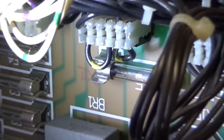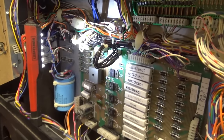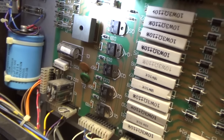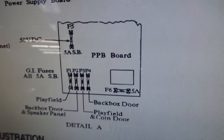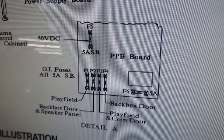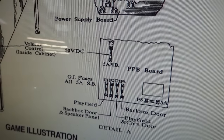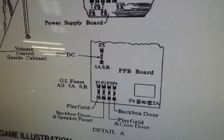How in the world were the flippers working? We need to replace that fuse. I pulled it out — it was a 5-amp slow-blow. And in the manual it says PPB board fuse F5, 50 volts DC, 5-amp slow-blow. That is correct. I tested the bridge rectifier — it's completely fine too. So we've got fuse after fuse after fuse blown — that's the fourth fuse blown for no apparent reason.